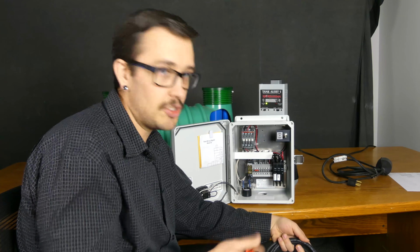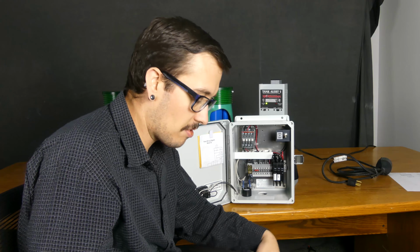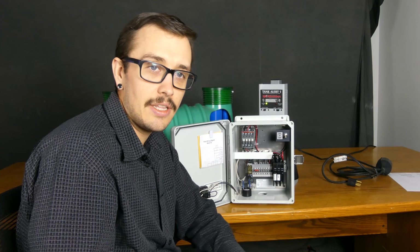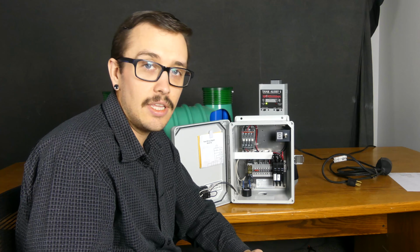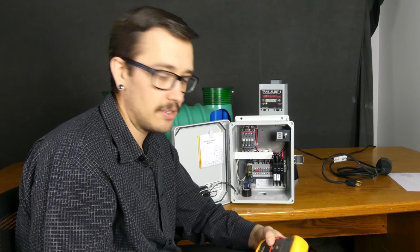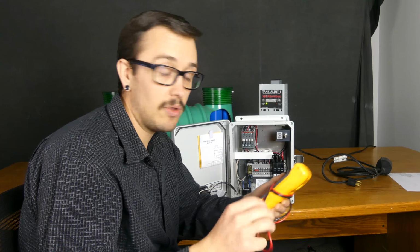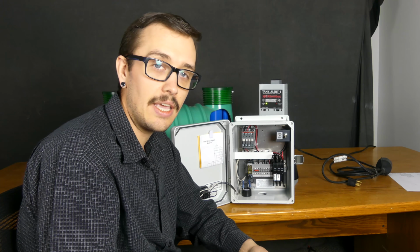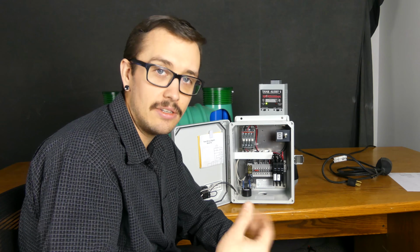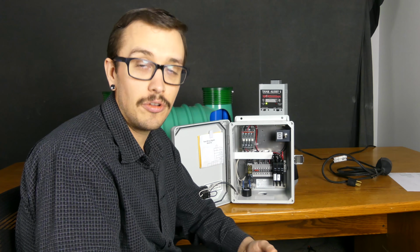And you can jiggle the switch or what have you and test it more if you want to be more thorough, but basically it did what it was supposed to do. It was on, or closed, as I said, in the up position and open in the down position. That's what we're looking for. Move on to the next switch and roll through those different switches, and you may have to actually pull those out of the tank so that you can orient them up and down and determine if they're opening and closing when they should be.